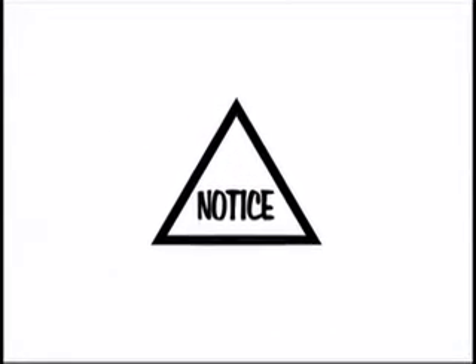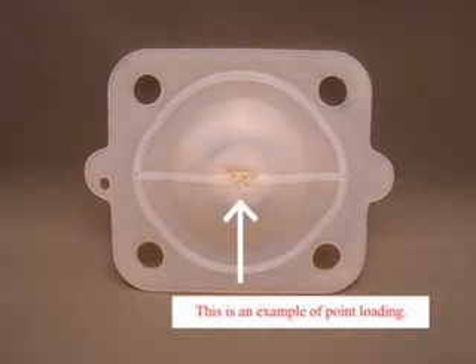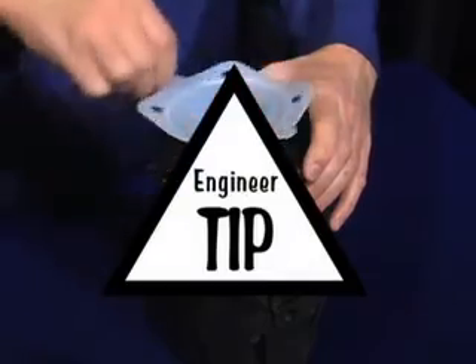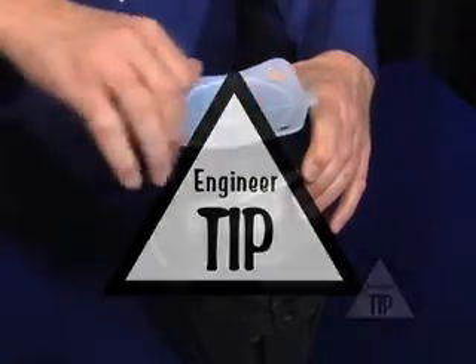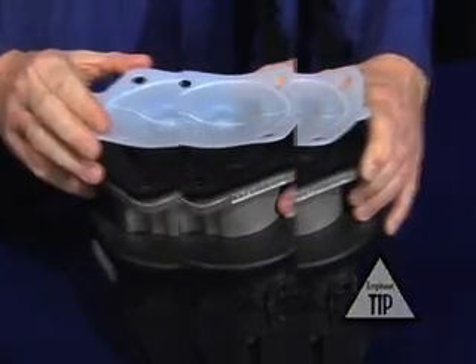This step is crucial in the installation of your diaphragm. Applying too much force and securing a fit that is too tight will result in damage to your diaphragm. Having the diaphragm too loose will result in the valve not having a proper seal when closed. This is considered point loading. Therefore, to remedy this situation, it is suggested that you rotate the diaphragm relatively slowly to ensure proper installation.